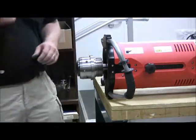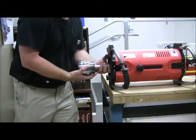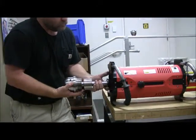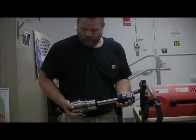Once both shoulder bolts are removed, the piston assembly can just be pulled straight out. Do support the piston and try to pull it out very straight, so that you don't damage the sides of the chamber. And there you go, removal of the CIRT impact assembly.